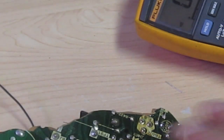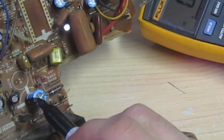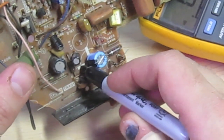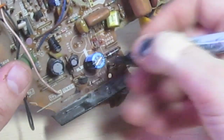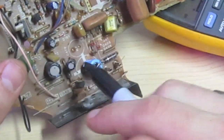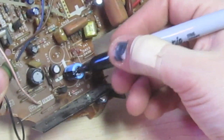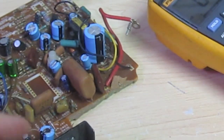I clip all the leads at the end. Here's another little tip: after I put all my capacitors in, I come in with a Sharpie and double-check my work. I look at the capacitor and check the polarity to make sure I lined it up right — there's a line on the board and a line on my capacitor, so I know I put it in correctly, and I'll put a little black dot on it so I know I tested it. I do that for every capacitor I replaced, because nothing sucks more than doing all this work, putting it in the game, and having capacitors pop — then you don't know which one you put in wrong. It's better to double-check polarity with the marker before putting the game back together, and if I'm really suspect of a connection, I'll use the multimeter on continuity to confirm.